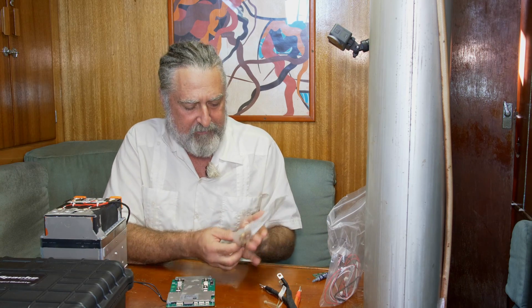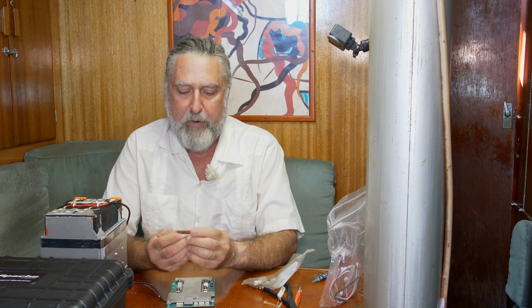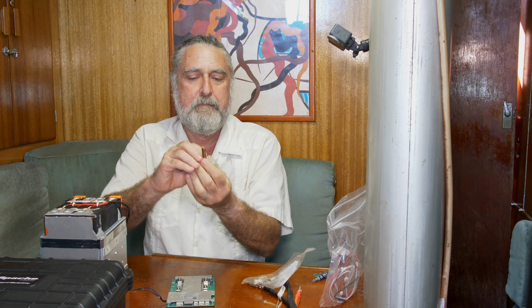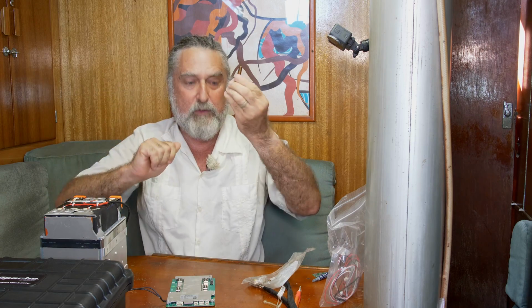I bought some bronze fasteners. I bought 3/8 inch bolts and nuts and all. Bronze is quite conductive to electricity. So we're going to drill some holes in the case, run these bronze fasteners out and lock them on to the terminals on the inside. And then that'll give us a good place to hook power up to.